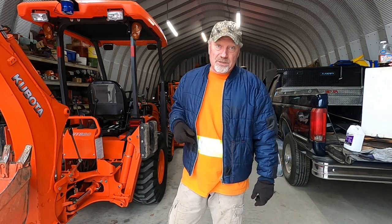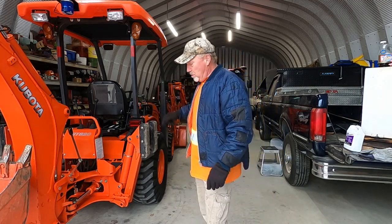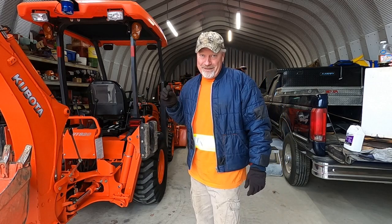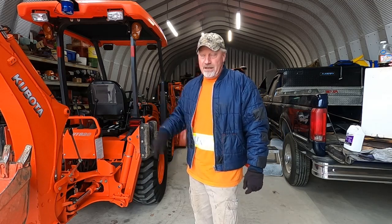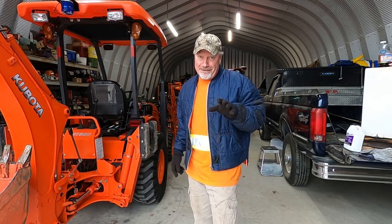this affair that we got going on in this B26. We're just going to pull them off from side to side and switch them around. Your tread pattern will work out and they'll go on. They are loaded, so they're a little bit heavier, but these are not huge tractors, so there should be no issue switching these around. I just thought it was kind of neat that this guy picked up on this, boom, and he's seen it. I've been working on the tractor, detailing it, for 3 days now or whatever, fooling around, and it just didn't even click on me. One day, maybe sitting down having a coffee, I might have looked, but that's not the point. I didn't see it, and it was just funny.